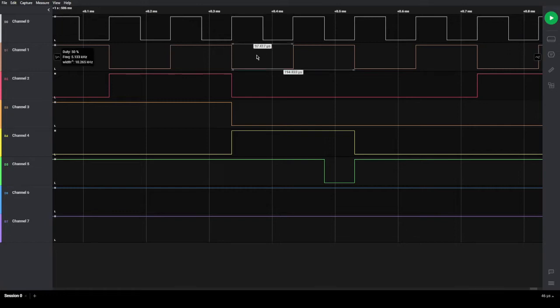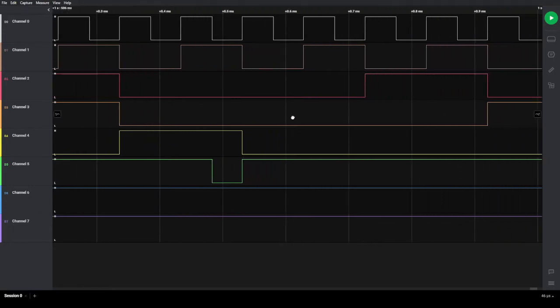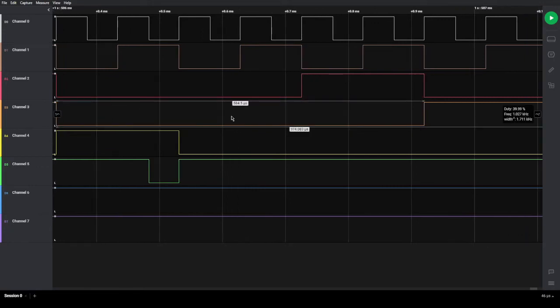And then of course I pick up these are the 4 BCD digits that it comes up with. So when it is low, see over here, it says low on the bottom and high at the top. Let's start over here. This green signal here is actually the carry. So when it goes past 9, it outputs this signal here, so that you can concatenate different digits, and that's what that signal is for. It tells you that it's starting over. You can just use the mouse, hold and drag it and move it over.